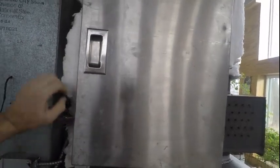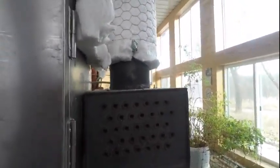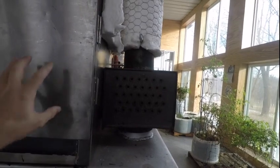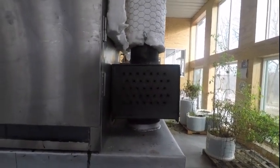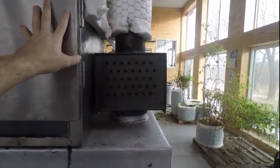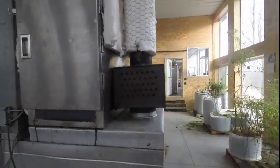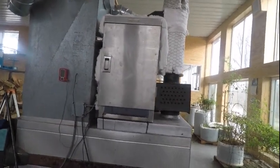I've got another video about the smoker attachment, but the basic premise is: smoke comes up here through this box, up through this box, and you can cook your food in here. There are racks and a pizza sheet to catch drippings, and a damper to control the flow and make the smoke go over into the box. I didn't put the smoker directly above the furnace output because that would put the reclaimer too high to move the cleaning rod. I also didn't put it above the reclaimer because it would be too high and salt, seasonings, and fat dripping on the reclaimer tubes would rot them out fast.